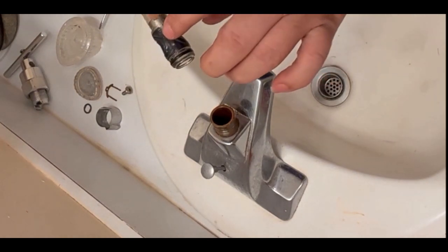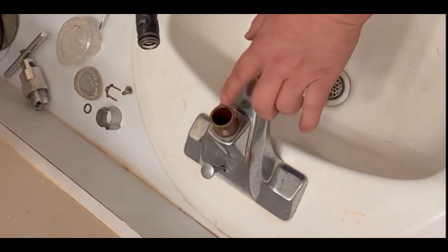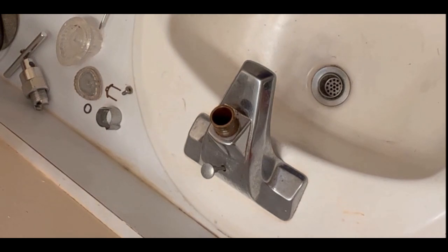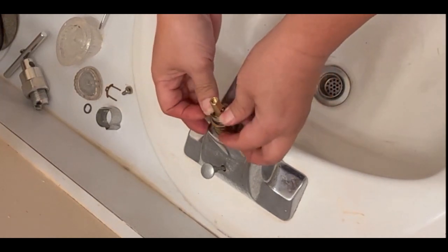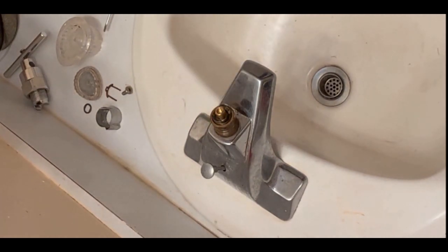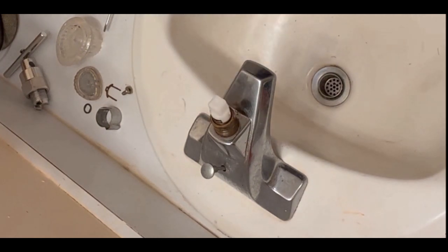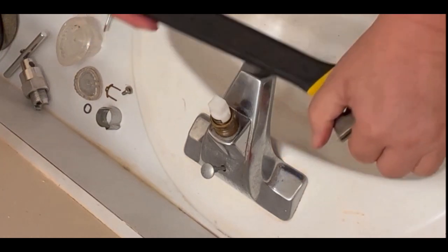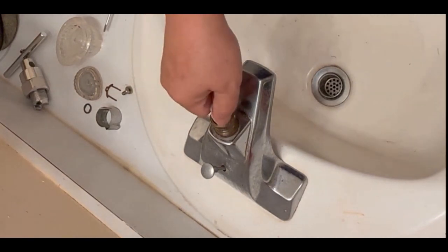Normally the new MOEN already comes with some grease on it, but I also put in here so that things go easy in. So I'm gonna turn this down a little bit to the left. Okay. So insert straight in like that. So you also need to push this thing in by using some tools like what I have right here. I push all the way in. Okay, so now it goes all the way in.